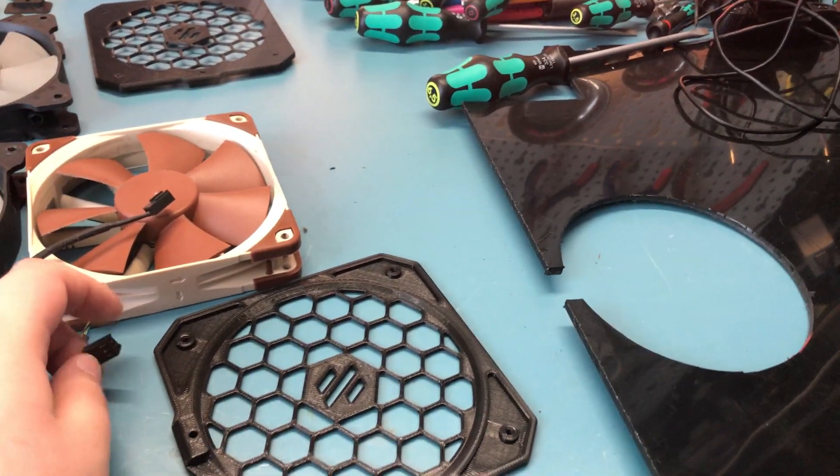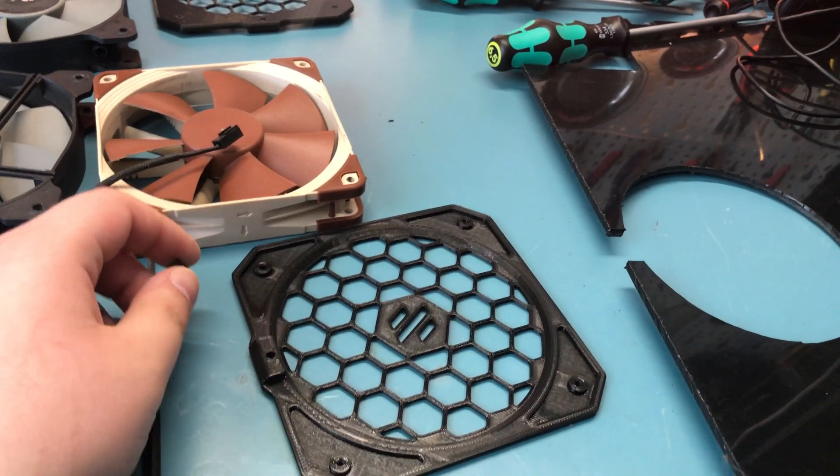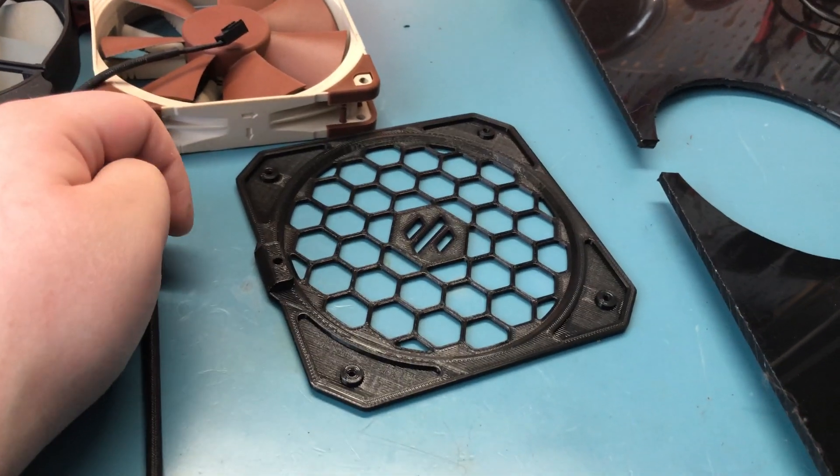The secret to that is since this is a very thin piece of metal, it cools down very quickly. You just bend it and the parts pop out very easily. You can just put the bed back in and start the next batch of printing without having to cool down and then heat up again.